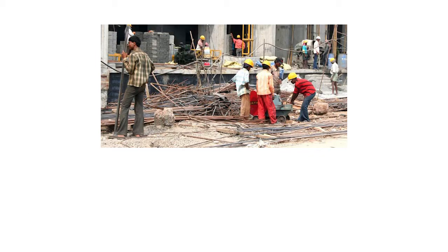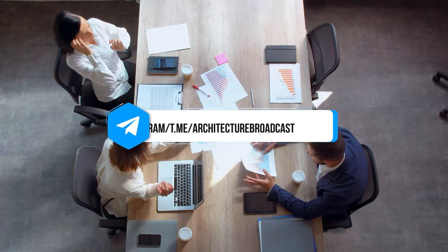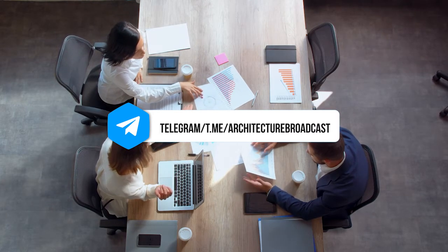For this project, the labor cost is around ₹350 per square feet, which includes foundation, roof centering, and column work. The contractor's profit is 15% of the construction cost, and the architect typically charges 7.5% of the total construction cost. I hope this video has given you a clear idea about how much it will cost to build a 1,200 square feet building.